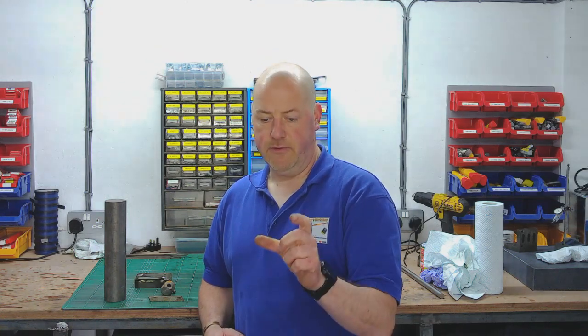In this video I'm going to make a fly cutter, a decent sized fly cutter for the mill. The reason I'm doing that is because I want to crack on and make the Dickson tool post adapters, and I've got some steel here already for that, some ground flat stock or O1. I need something that's big enough to span that so that when I square all the block up and mill it down to finished size, I've got something that will do it in one sweep.